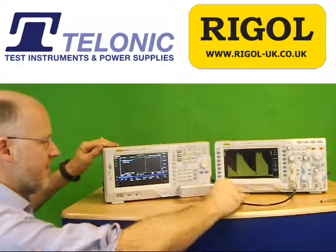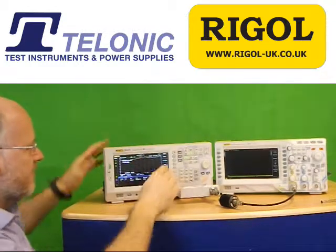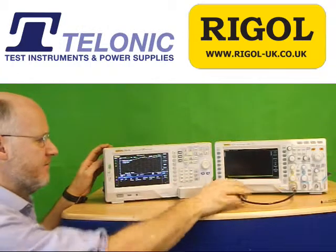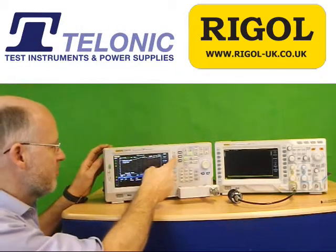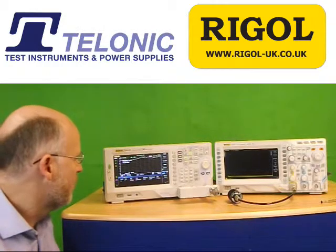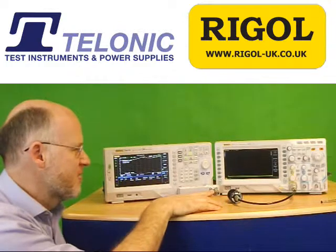Here we have the bridge attached to the front of an 815TG. We're going to place this 815 into VSWR measuring mode, and I'm simply going to ask it to calibrate with an infinite VSWR — so I've got nothing connected to my measurement port right now. I push one button and the system calibrates VSWR. It shows 184 to 1, which is not a sensible number, but that's what we'd expect — a high number because we've got nothing attached to the measurement port.